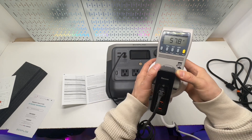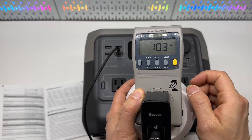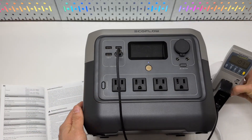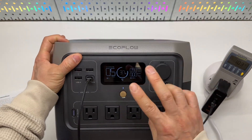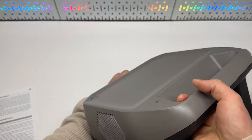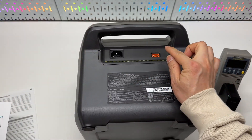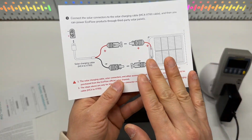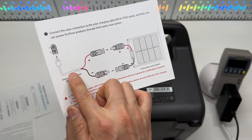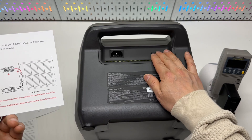The charging increases — it hit 100 watts, a little bit over due to conversion loss, so it's not going to be 100% efficient. That's the second way to recharge it. The third way is by using a solar panel via the XT60 port. You can use a generic solar panel with an MC4 connection and an MC4-to-XT60 cable to recharge the battery bank.